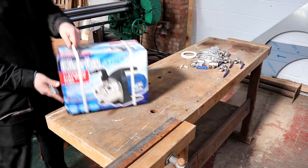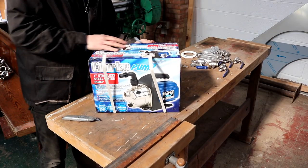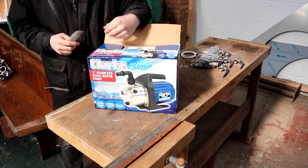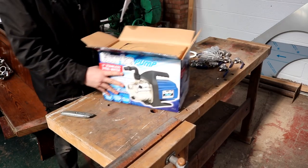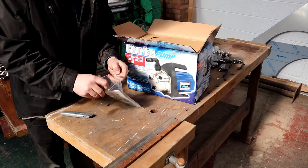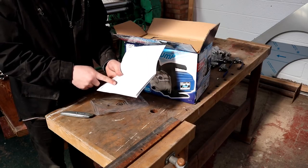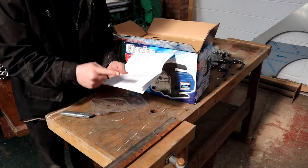Let's have a look at this stainless steel pump from Clark's. I've used these before - we had them on the cask washer at IVB. They're not really suitable for transferring any hot wort but they're fine for transferring water up to 80 degrees, so they're good for the HLT transfer and they're fine for cold liquor transfer. If you want to belt water from your cold liquor tank through a plate chiller, they're golden for that. It says they're designed to operate with clean water only at a maximum temperature of 35°C, but I did use the other one up to 80 degrees with 80 degree caustic.